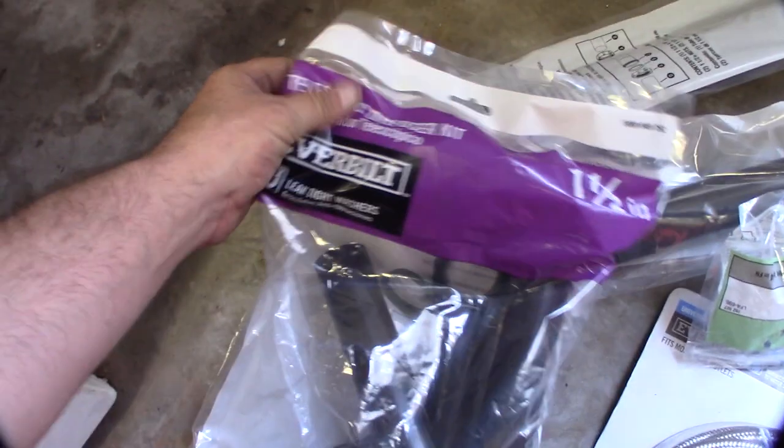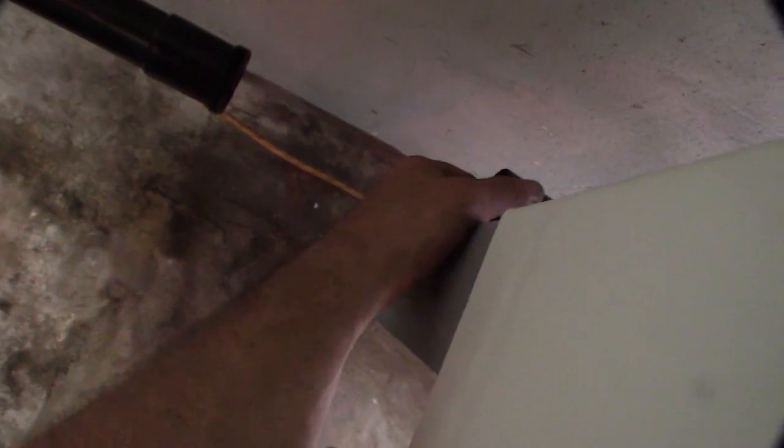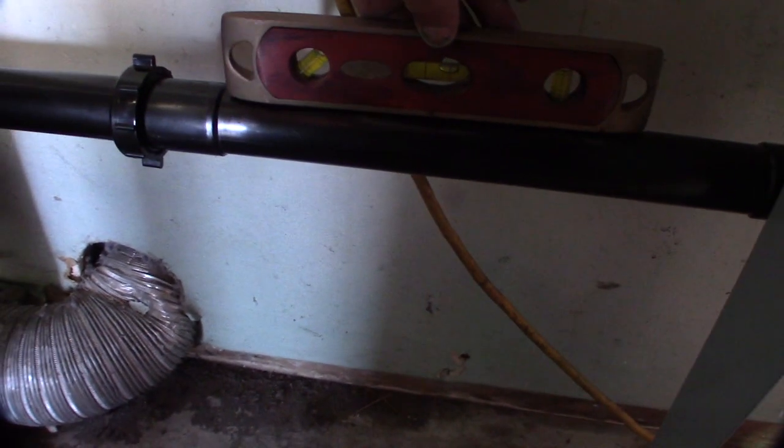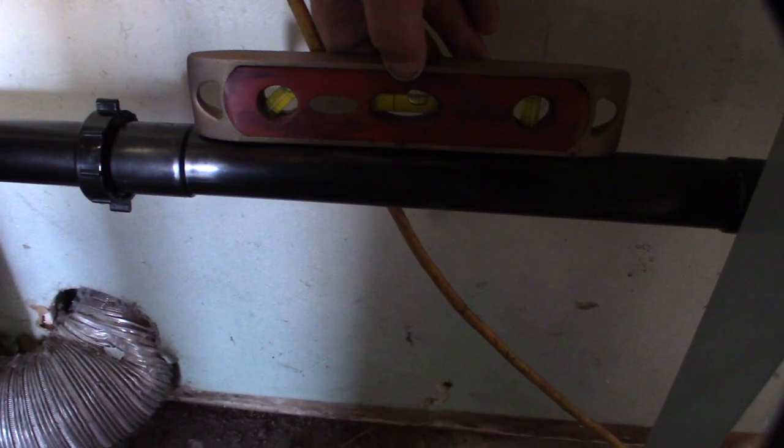The first piece is a telescopic disposer kit — it gives me a T-fitting to tap into the drain line right here. The T goes in, comes over this way, and feeds into the bottom of the sink. I'm adding extension pieces and keeping it at a slight downward angle so gravity feeds the water down to that drain pipe. You can see the bubble showing it's going downhill — the drain plumbing is figured out.